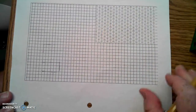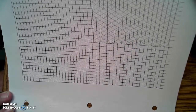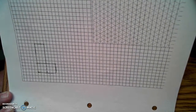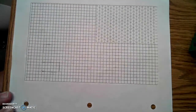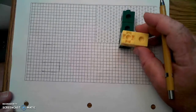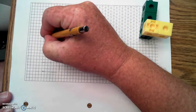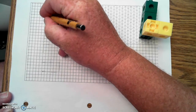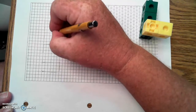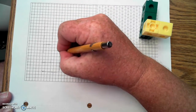So if I tip that up, sometimes you can see this much better that way on the camera. So that's my front view. All right, so I generally go to the top view next. That helps me keep my drawing area clean and not smudge it up so much. So I'm going to just project up from my corners like we described earlier for my top view.